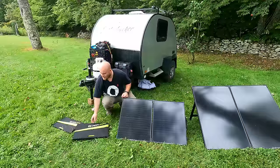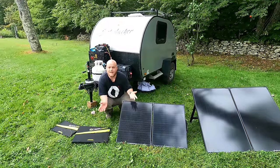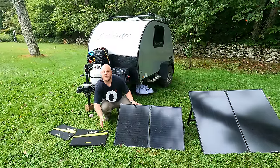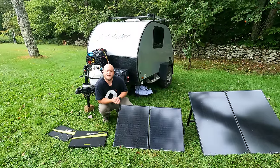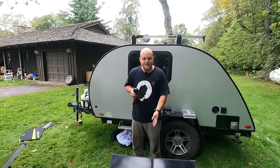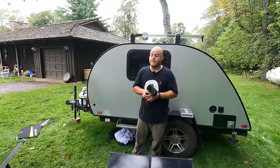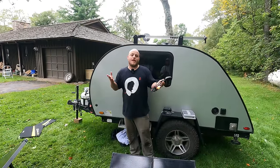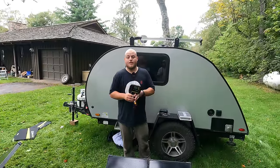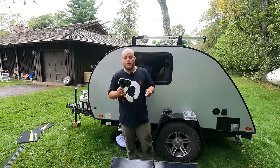A lot of those hybrid panels get broken compared to the more durable glass panels. They're also not as flexible — when packing them away they're heavier and take up more space. There's a panel out there for everyone, but I wanted to include those newer panels that fall somewhere in between. For this demonstration, we've zeroed in on a 100 watt glass suitcase-style panel that folds up. We also selected a 100 amp hour AGM. The next thing we need is a charge controller.